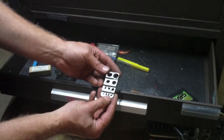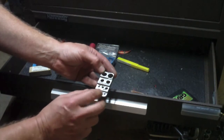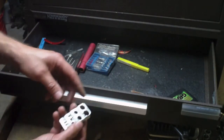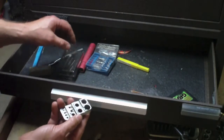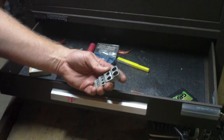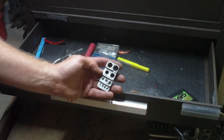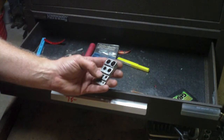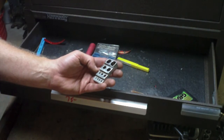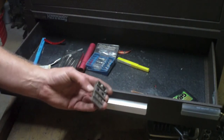Here's a little interesting doohickey. This is a little block that looks like somebody made, stamped. This is for if you want to check your size of your drill real quick. Just stick it into the hole there and you can see. So he's got all the big numbers here. Looks like a half inch. I see a 7, this is probably 7/8, 3/8, 5/16, 8 and 10, I wonder if those are millimeters, 14, 2, 4, 5, and 6 for these little holes at the bottom there, or maybe those are number-sized drill holes.